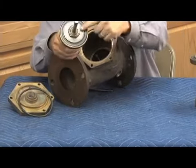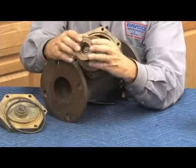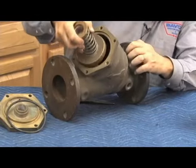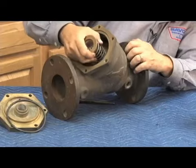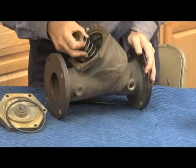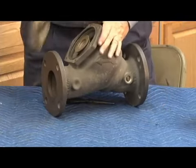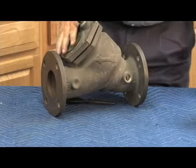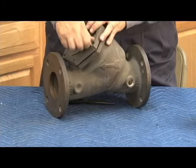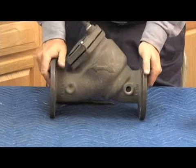Check stem assembly, one disc here. My stainless stem guides through the center of the seat. Also guides on the back side through the spring retainer where that clip is, as I showed you. So go ahead and insert back into the body. Back in place, just like that. Check cover O-ring on top. Cover bolts. And that's the check mechanisms out of the 709 and the check mechanisms off the 909 flange 2.5 through 10 inch.